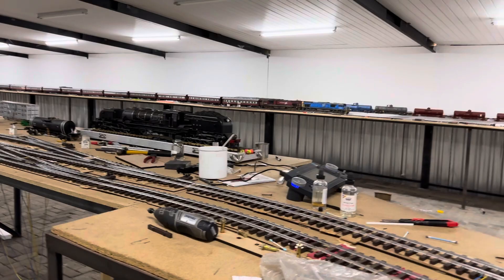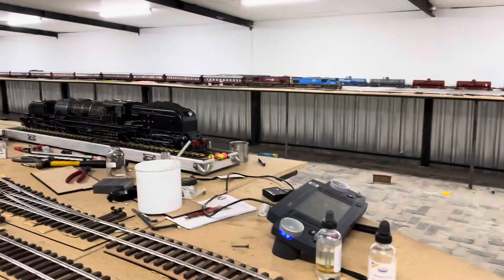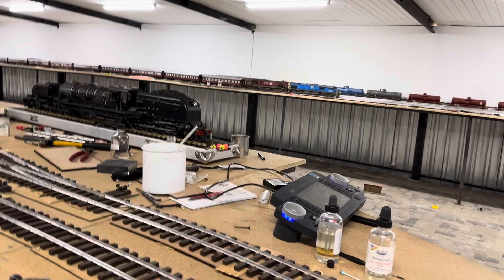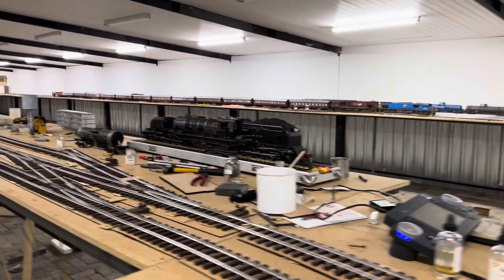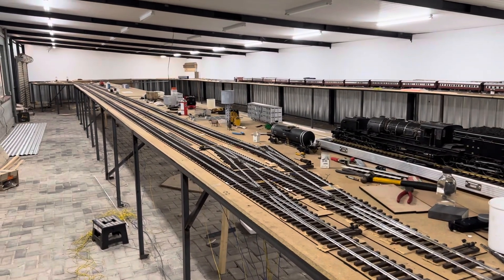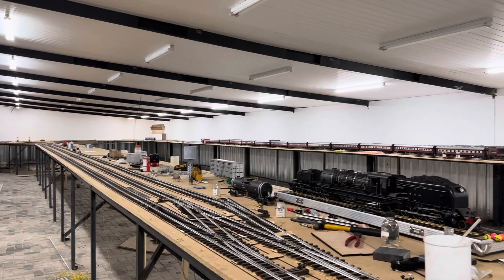Planning your blocks is very important when you fit boosters. But that is the key point about boosters — it doesn't add to the power. It doesn't make it 13 amps. You've got a 6 amp machine and a 7 amp booster — no, it remains 7 and 6. You've got to keep that in mind.